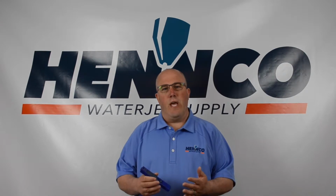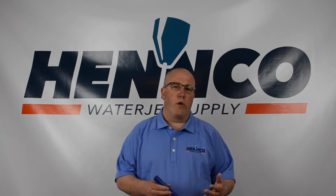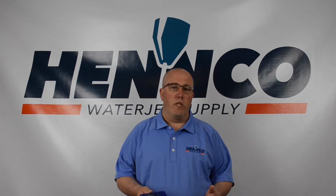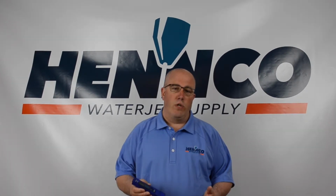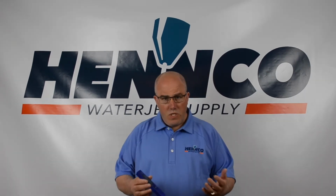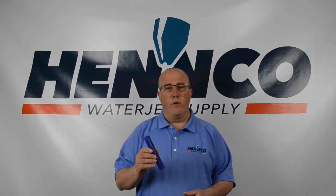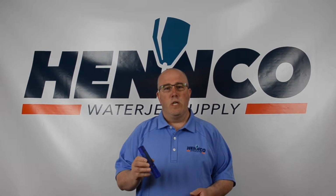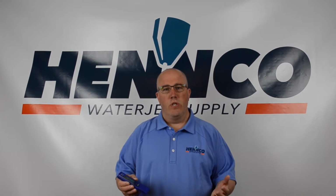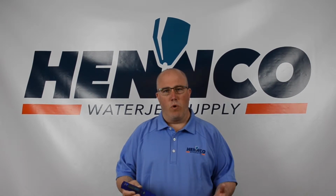In fact, when you look at the average water jet, we all have the water filters. The filters are really good for taking out suspended solids from our water, but they really don't affect the dissolved solids, which are really the things that can hurt our orifices, our seal life, our on-off valve kits. So it's really important when we talk about water quality for all of us to know what our TDS reading is, and from there we can help you understand and combat different solutions based on what that number is, or really give you an idea of what expected component life should be.